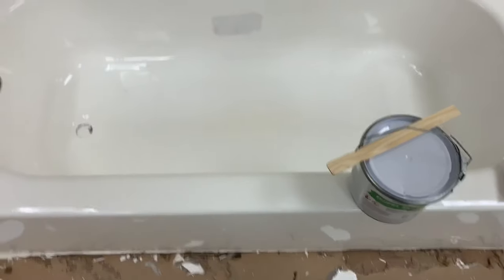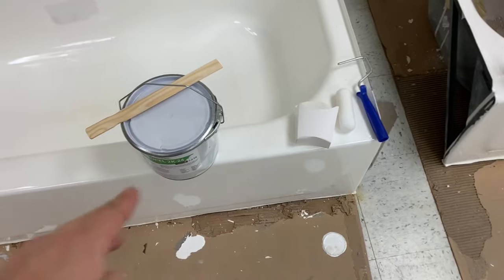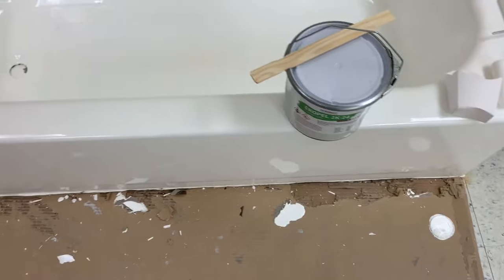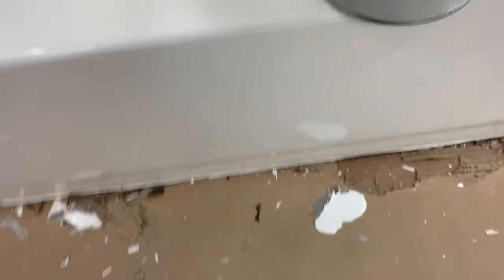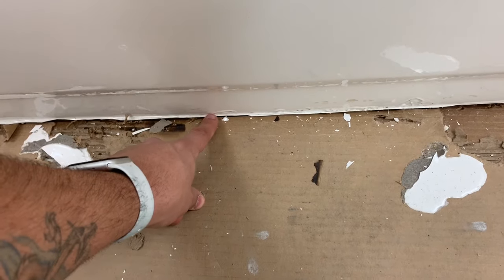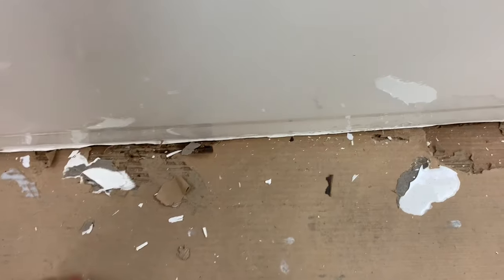In this video, I hope to answer a lot of your questions about random little things as well as show you the new updated install kit. I'm not gonna tape the tub, but normally what you would do: scrub everything down, then run a piece of two-inch tape around all the edges, around the four walls, and then put a couple pieces of tape on the floor and a couple pieces of paper. It's best to put it a tiny bit onto the tub - like an eighth to a quarter of an inch up - so no material gets underneath the tape onto the floor.